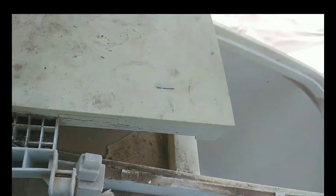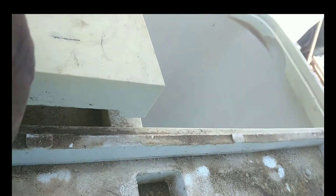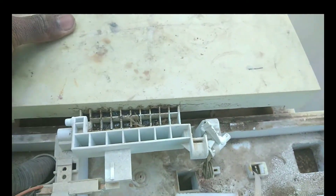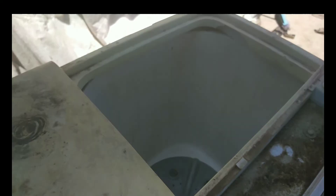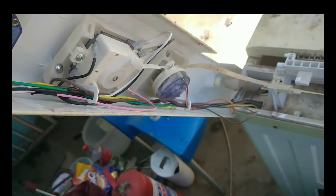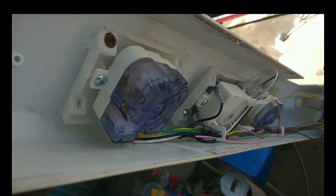The reason the cable was loose is because the deactivating lever is broken. As you can see, it is attached to the door, so when you open the door that is where the brakes are operated. After closing, the brakes have to let the motor spin freely, but as you can see the lever is broken.